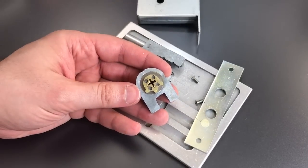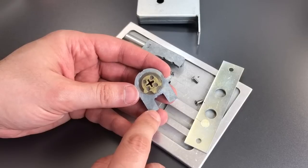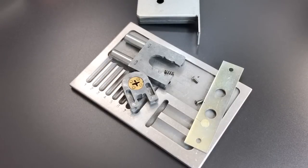So that is as far as we're going to see. In any case, I'm relatively certain that what we have in here is six pins — probably five standard and one spool — though there may be other security pins hiding someplace, but they just didn't come into play with the bitting. I can never be sure about that without opening it up, but that's what I felt.